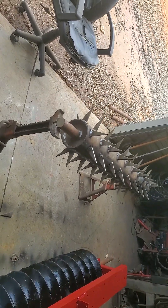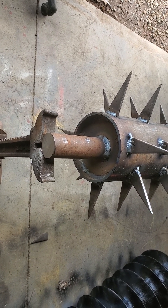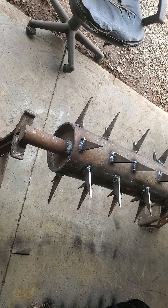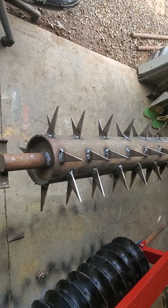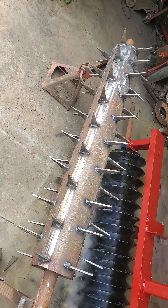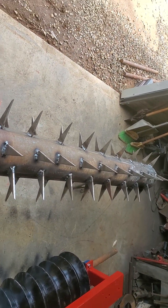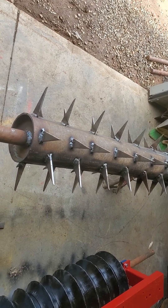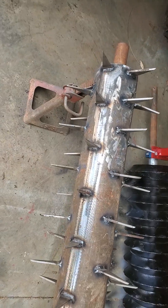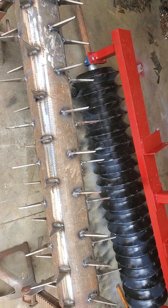I'm going to make that into a pull-type aerator. It's a six-inch tube — I welded a little end cap on it and put a two-inch solid shaft all the way through it. I don't know what it weighs; I ought to get a scale out here and weigh it. Once you put all those spikes on it, it's hard to handle — those things are sharp, they'll get you. It ought to really do a good job aerating. It'll work good on a four-wheeler or a lawnmower, but honestly it's going to be pushing a couple hundred pounds. Anyway, just making some more stuff here, just killing time in the shop.